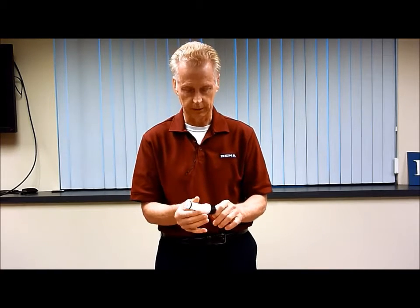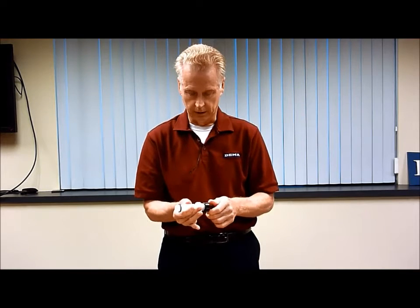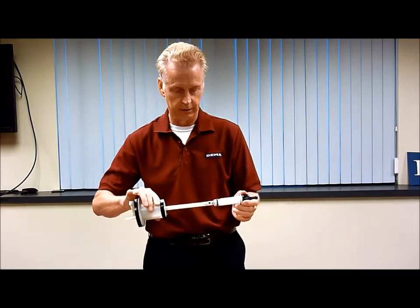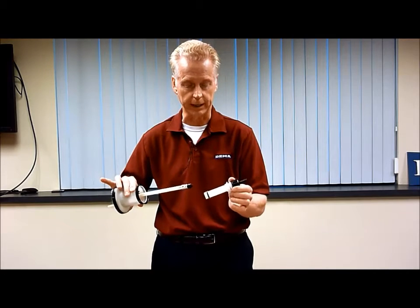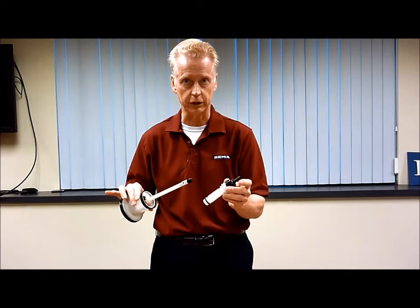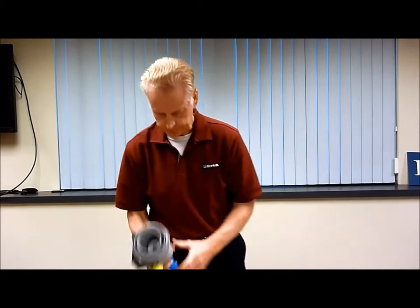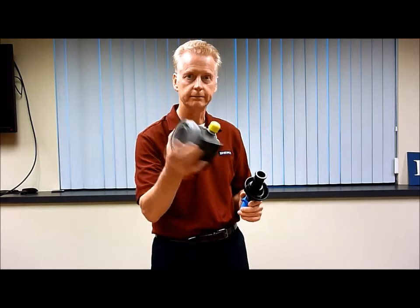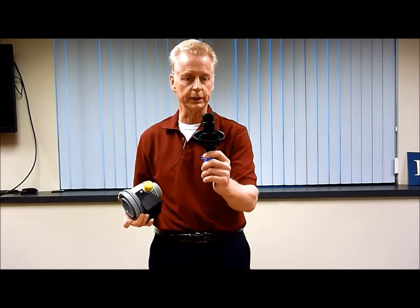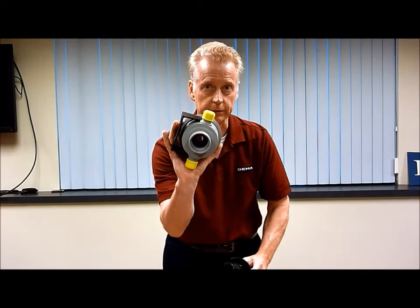This is your chemical cylinder. This is where the check valve goes into the bottom of it — you can see through it. This is an item that takes a long time to wear out. It's polyethylene — it's very slick. You can test the parts by pushing them in and pulling them apart like that. That noise you hear is the piston creating a vacuum and pulling the check valve open. So you can see it's a very simple device. You've got the cylinder, the support sleeve, and your nut. You can see the notches on that that have to go into the notches in the bottom of the unit when you're putting it back together.